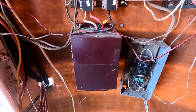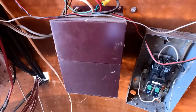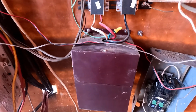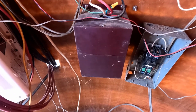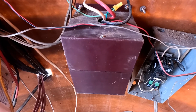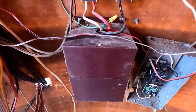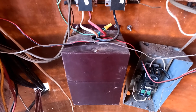One last afterthought on the transformer: it's rated at 6 kilowatts and in this discussion I've been talking about a generator rated at 7 kilowatts and really capable of supplying 8.4 kilowatts. To protect my credibility — one only need look at the AccuPower data sheet to see they have recommendations for short-term as well as long-term overloads. If they've rated this transformer like a real transformer manufacturer, that 6 kilowatt rating is valid up to some very high ambient temperature, and my highest ambient here is going to be about 45°C. This transformer has proved reliable, I'm confident it handles the power I'm using, and it's done the job for a year and a half now.